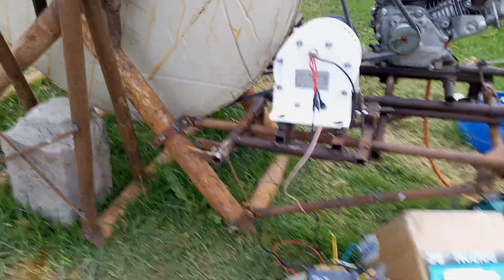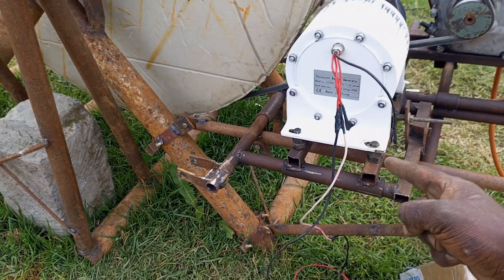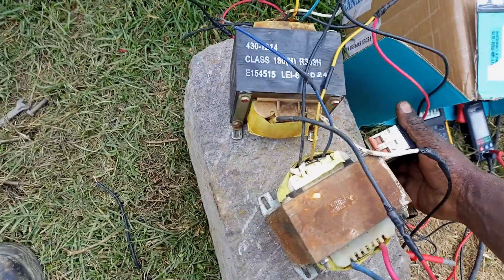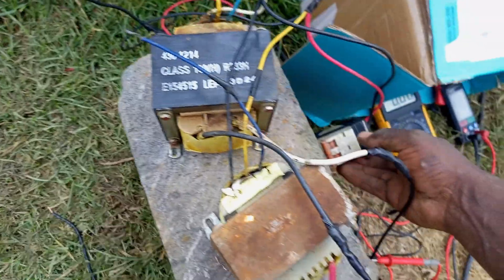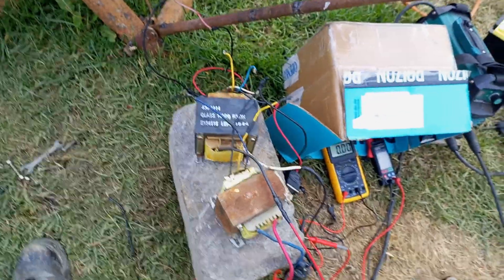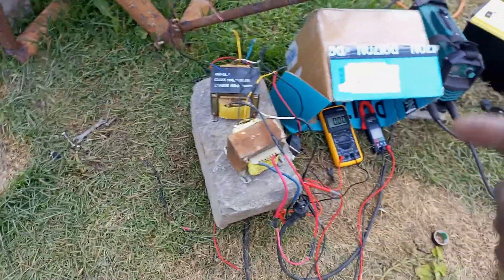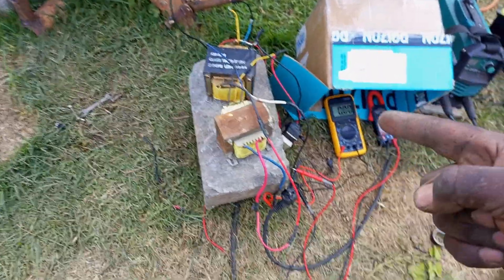Because of the high RPM we are going to have high voltage output — more than a thousand volts. From here I have these double pole switches; the double pole is currently off, and that is the one that connects the PMG to everything else. From the double pole I have these transformers wired in parallel — if you'd like to know more about that you can leave a comment and I can do a video on that.